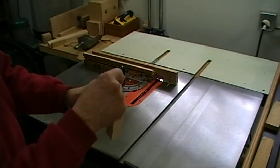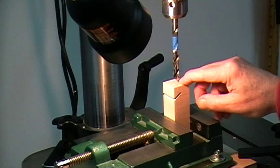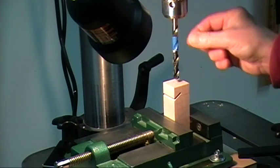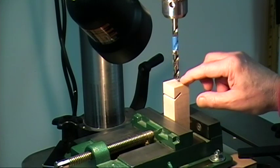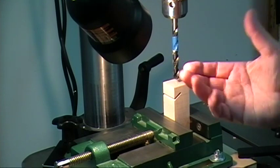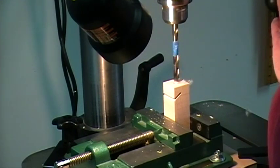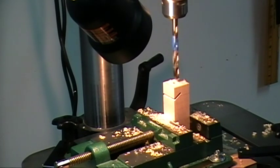Now we're ready to drill a hole in the center. You'll want to be fairly fussy about lining this up so that you get the hole centered as closely as you possibly can, so that it strikes the groove just in the right spot. We'll be drilling a three-eighths inch hole with a piece of tape marking it at an inch and three-quarters — that's the depth I'm going to drill. By varying that depth you can actually adjust the tone of your whistle, something you might want to play with to get one that suits you best.